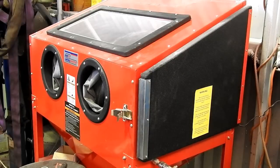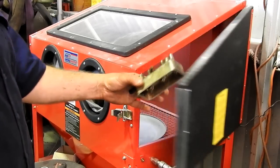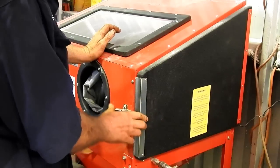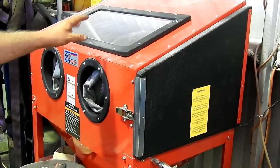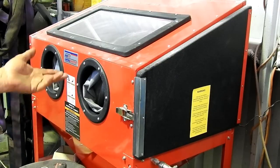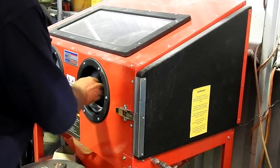I often get asked how I get the housings and that so clean. After I give them a bit of a bath, I have a blast cabinet. So I put them in the blast cabinet here. I run glass beads in the cabinet. Now, I won't be able to show you in there, it's just a dusty mess, but you'll see how it goes in. I'll do a bit of blasting and we'll bring it out and I'll show you the difference.